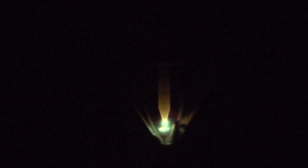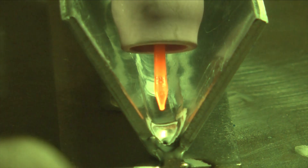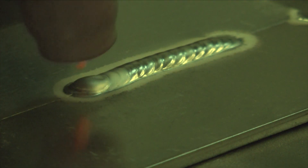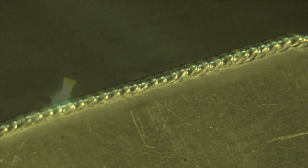The higher settings are helpful when welding in tight areas or where more precision is needed, such as tight angle joints or maybe even the outside edge of a part where you don't want to affect the material around it. The lower settings give you a wider, flatter bead, good for butt joints, areas that need to be built up with weld material, or possibly even outside corner welds depending upon the material thickness.